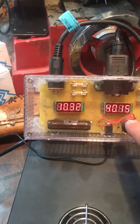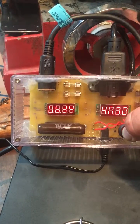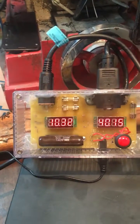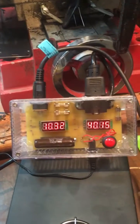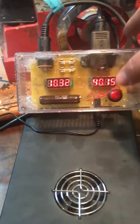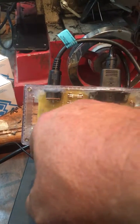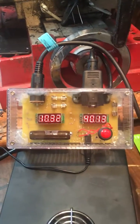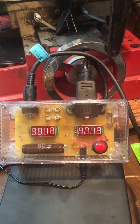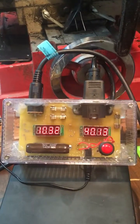Watch this — when you put a load on the 10-volt line, watch what happens to the voltage. See that? What that means is that this power supply is actually bad because it can't crank out the approximate 2 amps of current that the piano needs to play properly. So if you were to hook up this power supply to a piano, it would not work. It should just drop to about 9.5 volts — no less than 9 — though it has to have at least 9 volts or the piano will not work. Usually with the 40 volts, if you've got 40 volts, your piano will play. There's such a huge amount of current going through that, and I've never really had problems with the 40-volt supply.